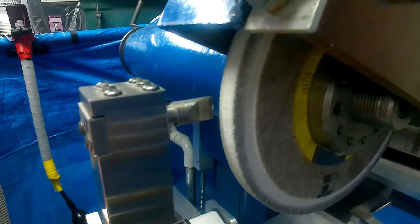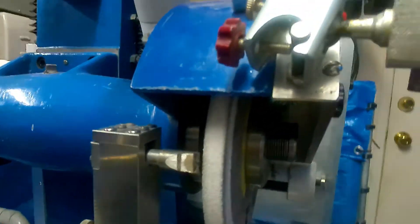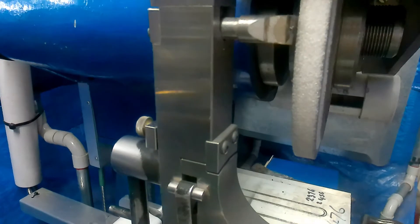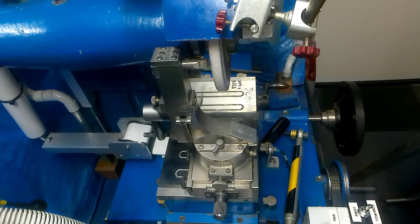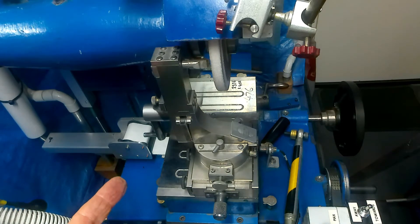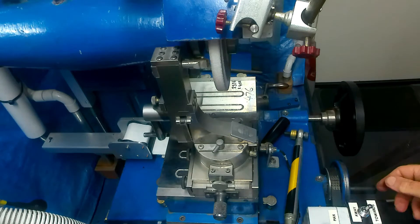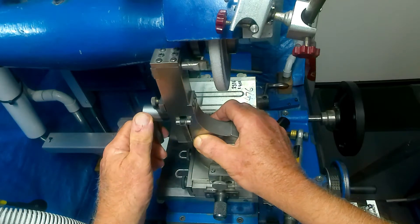It's also got a motion for actually sweeping the wheel. The idea is, bearing in mind, you want to lock the table as well so you've got no fear of it moving. As I was saying, this is only going to be a demonstration without cutting. Assuming we are ready to dress the wheel and the clearance is confirmed, you would advance the saddle into the wheel.